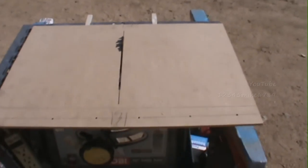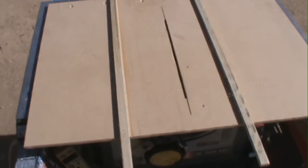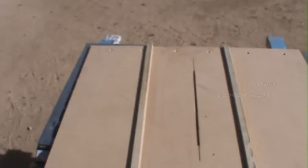So now that I have this big cut, and this little cut, that sucks. So I'm just going to go ahead and find a piece of scrap Formica and laminate this whole thing out. And that way I'll still have the precision of this nice little cut. Another thing I noticed is this is really tight. So after it's waxed, I'm going to try to release some of this tightness on here by block sanding this. I'm just going to spray some WD-40 on it too.